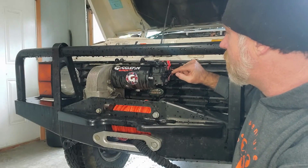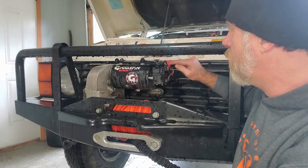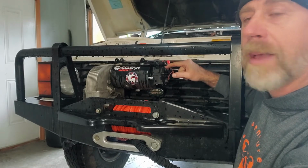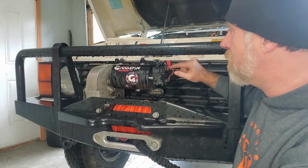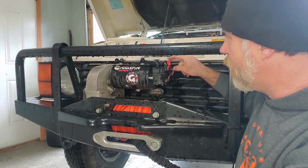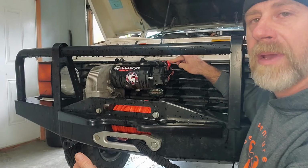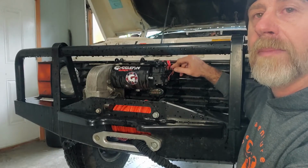And all you're going to do is, you still have your power hooked up, so everything's still hooked up like it should work. You're just putting direct power to one of the 2 outside spades. That should be either in or out. Something should happen. Put power to the other one. The reverse should happen. If it does, if you tap those with power with your jumper wire from the battery, or you can even jump it from your power here as well with a shorter piece of wire, you're just taking known good power from the battery and applying it to those spades one at a time.